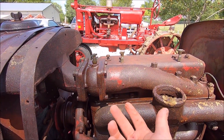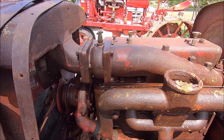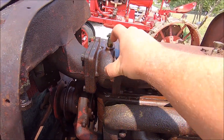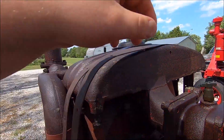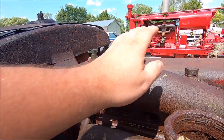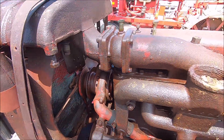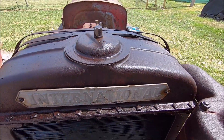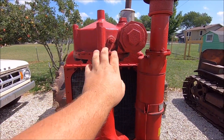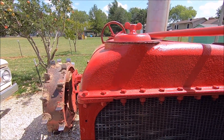You look at the water manifold on the T20 crawler — it is significantly larger, more similar to a T30 manifold off of a larger tractor. I have not confirmed nor disproven whether it's the same manifold or not; I don't have a T30 tractor, but everybody tells me it's a much bigger engine, so it must be different. That makes this a special casting just for the T20. There's a big thermostat in here. The top of the radiator is also special to the crawler because it's cast completely differently to take advantage of this water outlet manifold. Another quick difference you can easily spot: on the crawler the radiator cap is dead center, whereas on the F20 it can't be dead center because that's where the steering box is — so it's offset to the right-hand side, though it is the same cap.